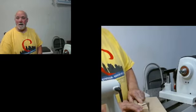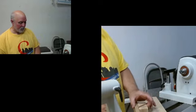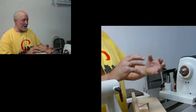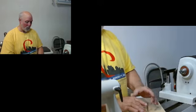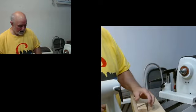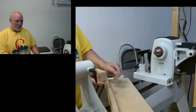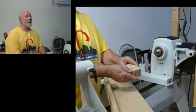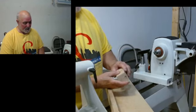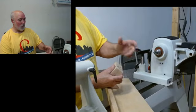Can you see all that? If I want to pull it together, I'll take a clamp and put it in the center, give it light pressure, not real taut and not real tight, unless you're trying to pull something back into line. But just light pressure from both the side and the ends, just enough to where the glue starts to squish out. Once I get to that point, then I can move on to, I always try to number it. 1, I don't know if you can see that or not. 1, 2, 3, and 4. That way I know which direction I'm going, so that I keep turning the same direction all the time.